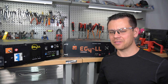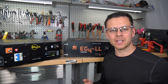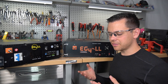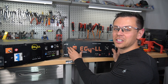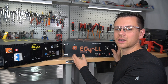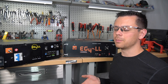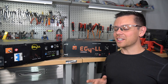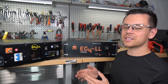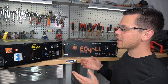Something I did not test is the fire arrestors. This is lithium iron phosphate, so even in a thermal runaway, it's not hot enough to catch paper on fire — about as safe as a big stack of wood. The electrolyte is flammable if it gets extremely hot, but you'd have to literally throw it into a fire. It will not spontaneously combust or have a self-propagating reaction like NCA, lithium polymer, or NMC batteries. The fire arrestors are included to conform to certain UL standards and compliance codes.